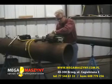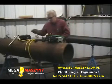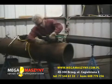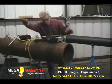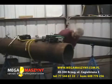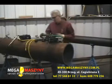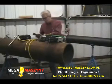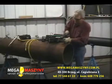Installation of the MagnaCut on the pipe is simple. Ensure the surface is smooth and free of debris in order for the machine to function properly. Place the machine on the pipe. Grasp the machine by the front and handle at the rear, and move the machine from side to side until the wheels fit the radius of the pipe. The full magnetic force can be felt when the wheels are in the correct relationship to the radius of the pipe.